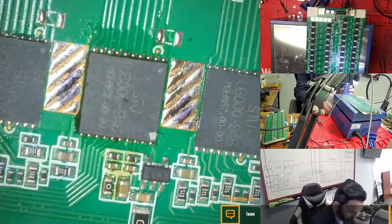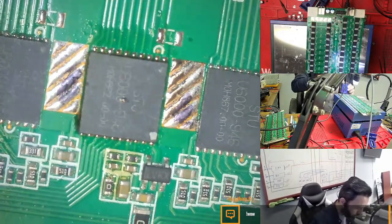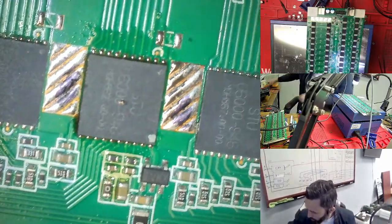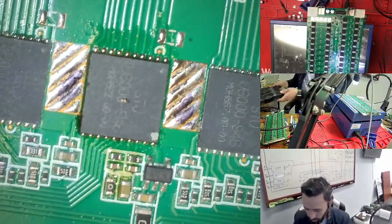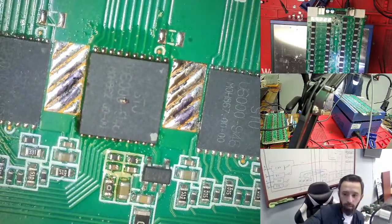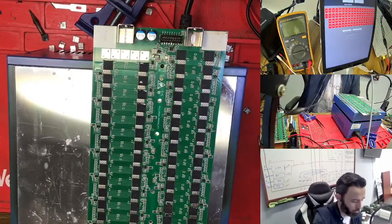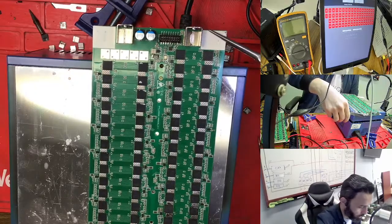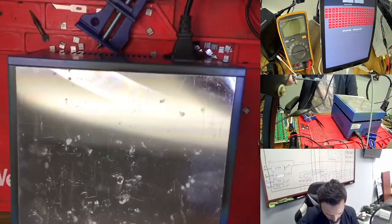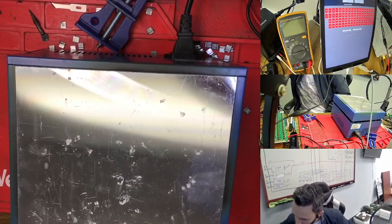What I'm doing now, I'm stopping my heat plate, so we need to take this one out. This hashboard we put aside to the cooling hub. We need this, these are the pliers to use to take the hashboard out from the template. Because it's very hot right now, you cannot touch it. So slowly you take it out and put it here on the cooling hub.